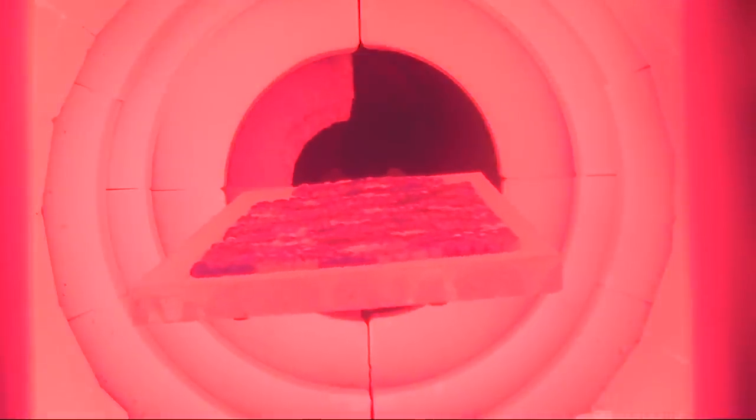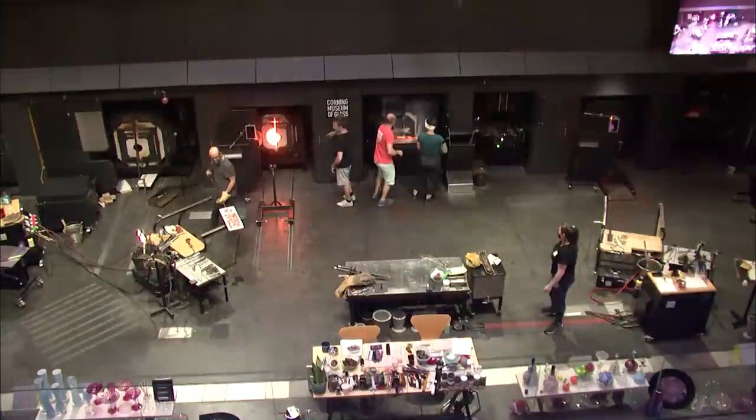The stainless steel that we use is a very poor conductor of heat, so it takes a long time for it to get warm enough, but with continuous heating in the reheating chamber, that heat slowly moves up the pipe, so we want to make sure it's cold enough, and we just cool it down with water. So that's what all that steam coming off was.